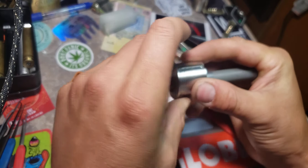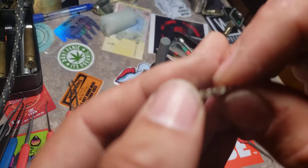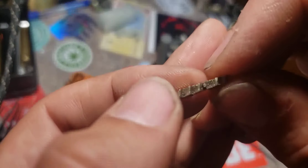It has a little pin that sticks out, and that's what I had to push on in order to get it to turn once it fell into the trap. When the key's in, it pushes it out and it can't fall into the trap. It does have like a half-moon piece of anti-drill on the front there. I don't know if it falls out of this one — I think it's just a matter of whether or not they pressed it in or not. Doesn't seem to be falling out on this one.